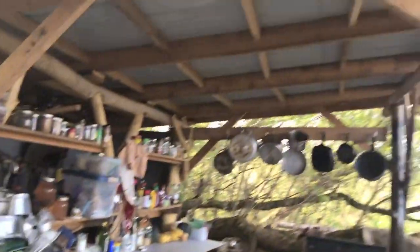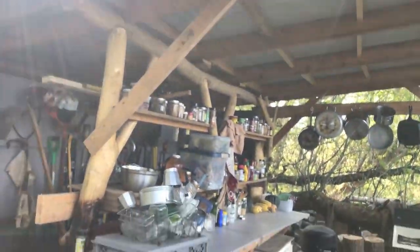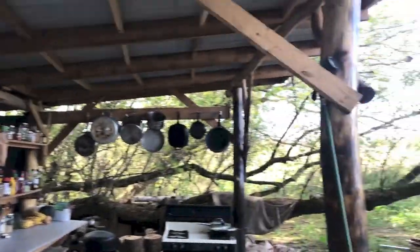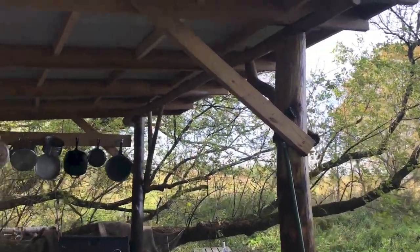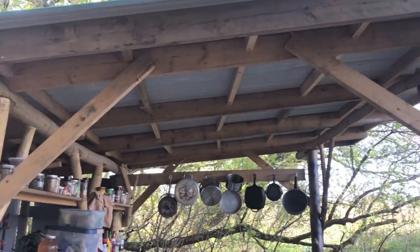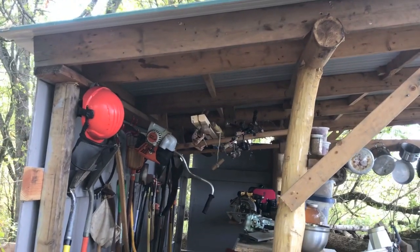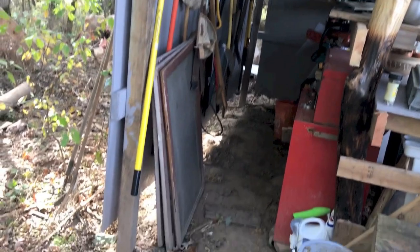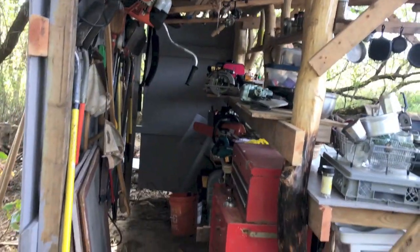But we decided when we put the rafters on the two bents, they're called, you can sort of see the back bent there with the 3 upright posts, and then the front bent here. That's what they call them when you're timber framing. We put rafters across those and made sure they're level. And when we put the rafters on, we saw that we had some extra room, or we could make some extra room. So we decided to let the rafters hang over and put some 2x4 or 4x4s in the back here for a tool shed, which was much needed. We didn't have a tool shed yet.